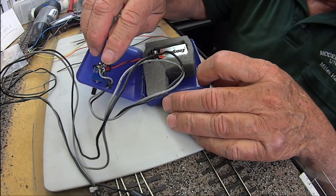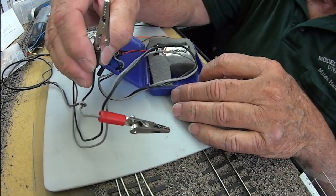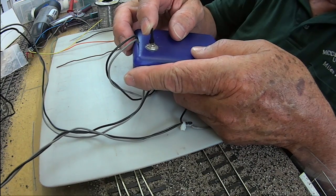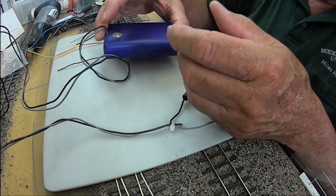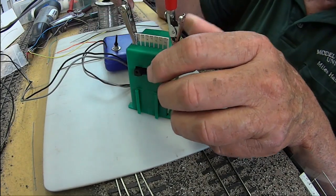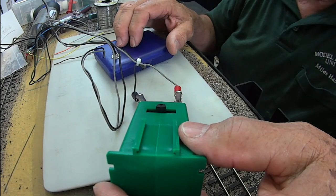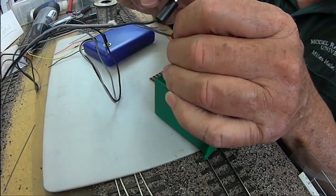I just drilled the case and mounted it up. The two wires that came out after my crossover — I'm using gray and black wires to my clips. Once I have that wired up, I have it set up on a switch that goes center, clicks down, centers off, and up the other way. The first thing I would suggest is to clip it on the outside connections and test it, because always test them before you go to all the work to wire them up.